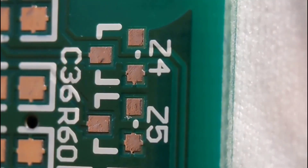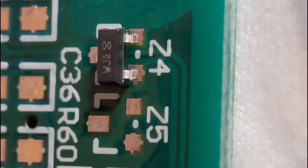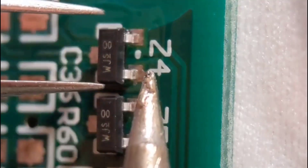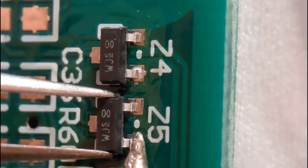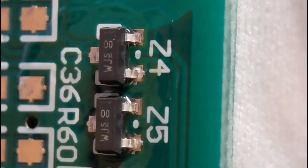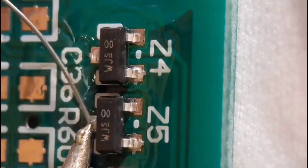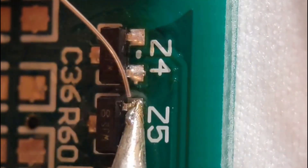This is done the same way as the resistors and capacitor. A little bit of flux again — it's pretty vital. I lift the component into position. I don't blob one pad like some other people do — this is just the way I like to do it. I get a little bit of solder on my iron and normally tack the bottom right-hand corner, just a tiny amount to hold it in position. Same with that one. Then I get a fresh bit of flux and go to the other end. You don't want too much on these — you can even see the outline of the leg, and that's fine. Getting these nice really helps in the future on the fine-pitch stuff.